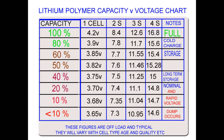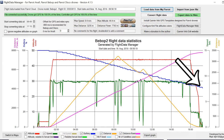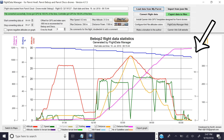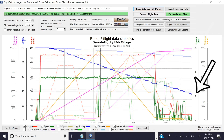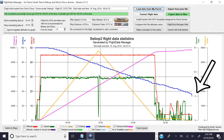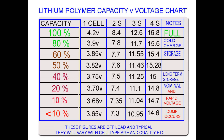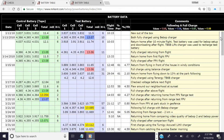The battery needs to be left at its natural storage voltage of about 3.75 to 3.8 volts per cell. What I often do — and I'll show a chart — is fly until it gets down to about 50%, since I don't have many long flights. If it's not at 50% when I land, I put it on my balance charger in storage mode, and it charges or discharges to reach about 3.8 volts. The minimum voltage you ever want a LiPo to reach is 3 volts, though about 3.2 volts is a safer discharge limit. For storage, charge back up to 3.75 to 3.8 volts. They fully charge to 4.2 volts.